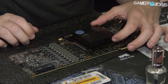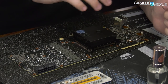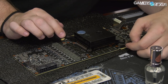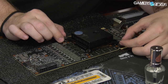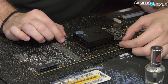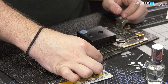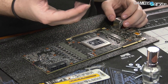We're going to mount this with some small memory heat sinks. For the record, when we were testing our hybrid card with the memory and VRM on exactly this same PCB, the hottest module was still like 55 degrees even with a heavy overclock, because we had so much airflow on it. This card will still have a lot of airflow but it'll be in the middle, so I will be adding some memory heat sinks just to improve efficiency a bit. We're just going to focus on the core here and getting everything else reasonable.